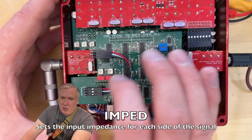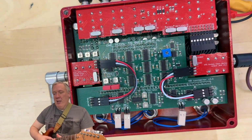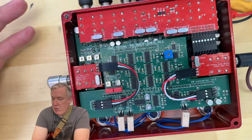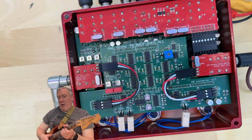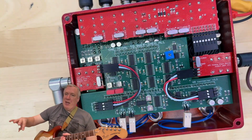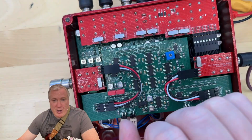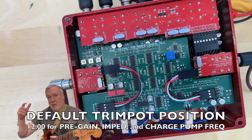There are two impedance controls. This sets the internal input impedance, and that has an effect particularly on passive instruments. By default, that input impedance is 1 megaohm, which is great for guitars and other passive instruments. Generally, it's not something to worry too much about, but it's there for those particular cases where maybe you want to try something a little lower to see how it interacts with your volume knob, or theoretically could lower the noise floor just a bit if you had an active instrument and a lower input impedance. Anyway, those are pretty minor, but I want to have on the inside controls over all the little tiny details. So feel free to experiment with that. The default positions for both of these is noon, so the easy way to return to normal stock space is just turn it to noon.